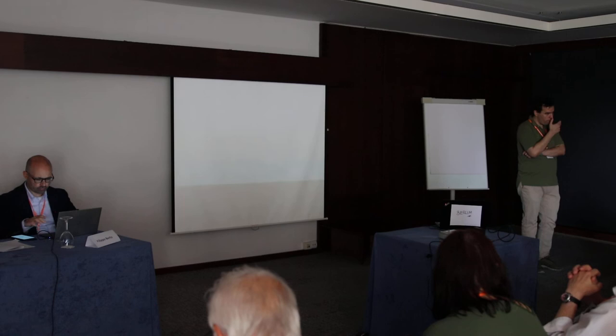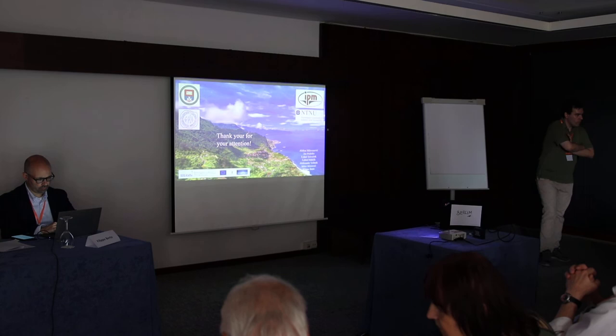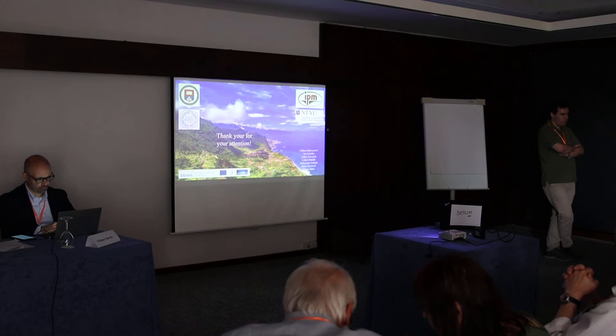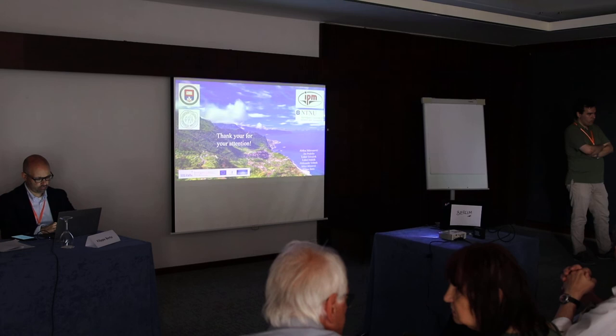The only difference, okay. Have you tried printing the material with just one type of layer, then the second type of layer, and measuring some type of fracture toughness, just to get an idea of what the plastic zone size will be? Then you can estimate why you get this distribution out of the one plane, which you have a problem with.